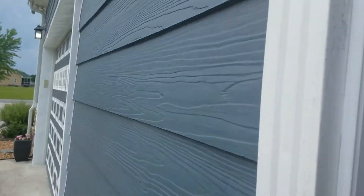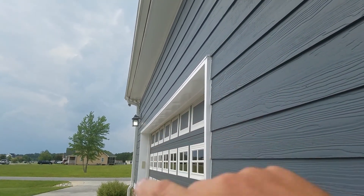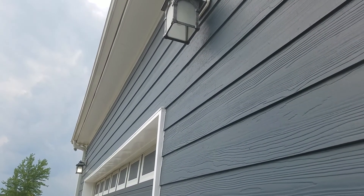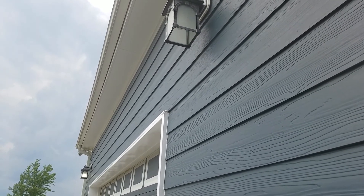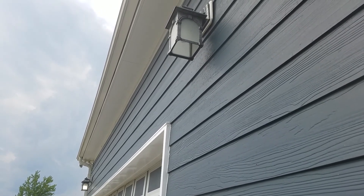Let's give this thing a test. We'll turn the power switch back on. The light that still has the photosensor should be out — and it is. The light down here that we bypassed should be on — and you can see it's lit up. Everything's working like we expect. So for the next couple days I'll just have to turn my own lights on and off manually like a caveman, and when the photosensor comes in the mail, we'll get that replaced. Should only take a moment — so stand by.